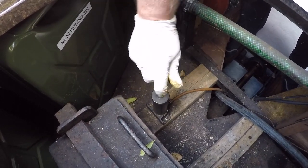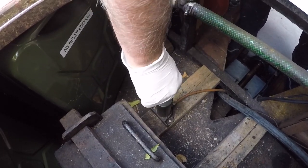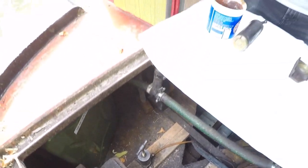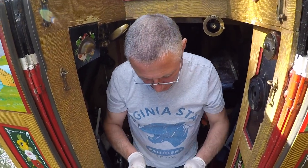I've got another job to do in a minute. I'm getting quite a bit of resistance on that now. So charge that system now down to the plumber block — squeeze the grease into the packing that's inside the stern tube.